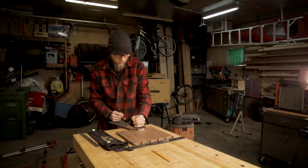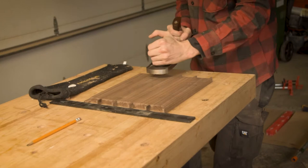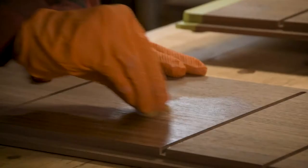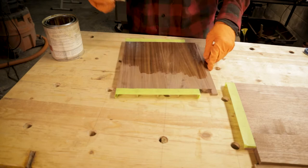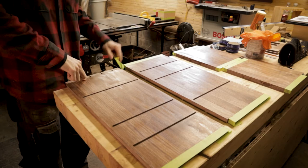The only thing you have to be careful of here is not to take too much material off the inside of your top and bottom pieces, because that will affect your dovetails. Then I can go in and apply a good coat of tried and true varnish oil. Anytime I'm doing cabinets like this I like to pre-finish, because it helps make clean-up on the inside of the cabinet a little bit easier, helps glue not to stick in there, and it's just a really hard thing to try and finish the inside of a closed cabinet since it's hard to reach all the corners. Wrapping a little bit of green tape around the dovetails and the pins can help you prevent getting oil on those areas.